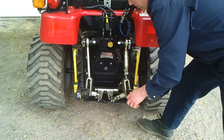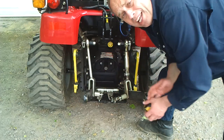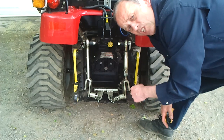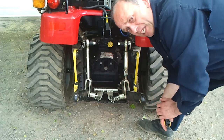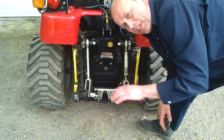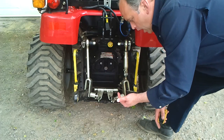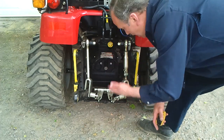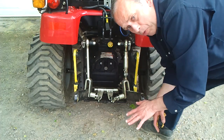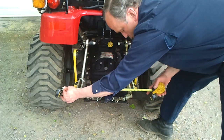Right now that's why they put the stopping plate right there. The reason they put these bumpers is because it's the maximum height for the driveshaft — not to break it. There's a maximum angle you can drive a PTO shaft, so that's why they put that. On the lower it's no problem, but higher — that's why they put these. It doesn't come with the backhoe; it's just for the rear snowblower.